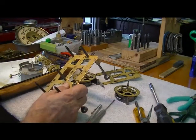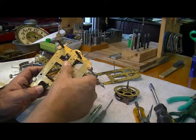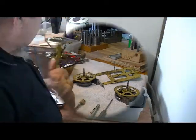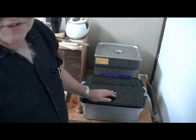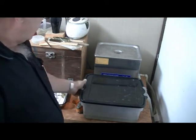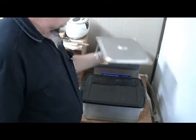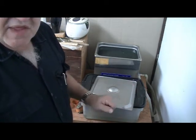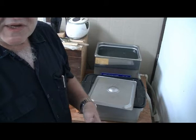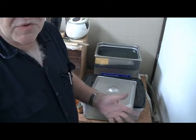After a quick inspection — that was filthy, filthy — we're going to put this in the ultrasound. Yes, this is real high tech right here. This is the ultrasound department. This is a vat of denatured alcohol — this is how you rinse the pieces after they've gone through the ultrasound. The ultrasound is a two-and-a-half gallon unit filled with cleaning fluid. It is a special secret recipe that's been used for over a hundred years by various watchmakers. It's ammonia based — believe me, when I take the lid off you can tell if you still have ammonia in there.